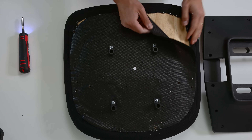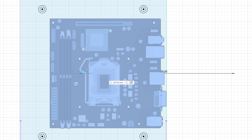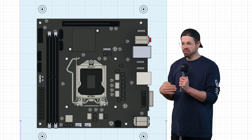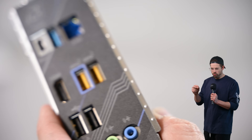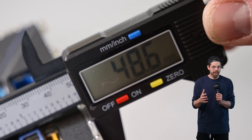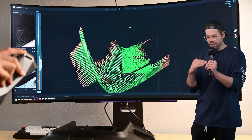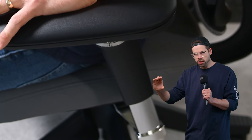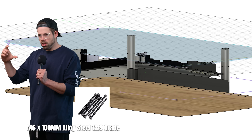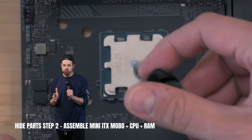Some nice solid wood — 195mm that way, 150mm this way. It's like it was meant to be. But this means I need one more requirement: when I sit on it, it needs to not crush the components. The thickness of the motherboard, CPU, and RAM is about 48 millimeters. So if I put 50mm aluminum standoffs and extend the bolts by 50mm, I can create a 50mm cavity for the motherboard. According to my research, 50mm thickness underneath the cushion is the max height before it becomes noticeable. We just have to use a low-profile CPU cooler rated for 100 watts, and it fits.